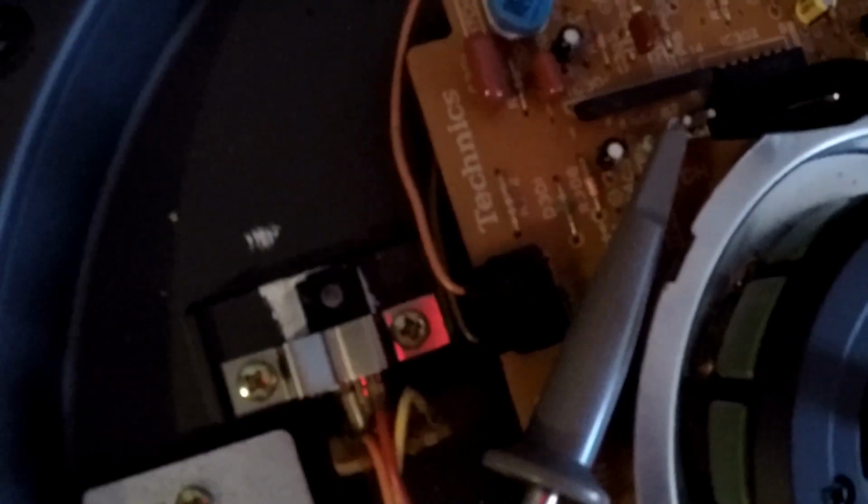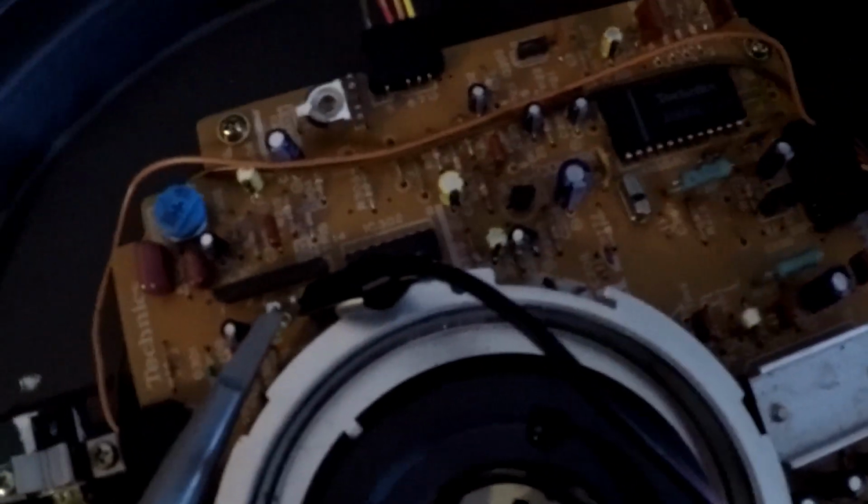This is the pitch. So I was able to take my multimeter and put it in the ohm setting, and according to the schematics, I should be seeing about 2.7 ohms, right? It's 2.6, that's perfect. I don't need to go crazy over that. But over here, we could do a little bit more adjustment.